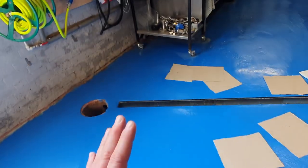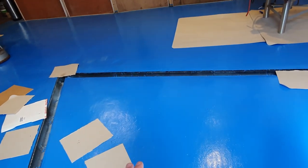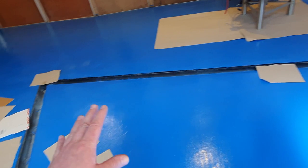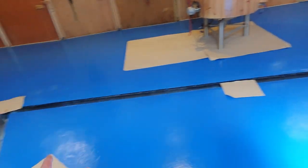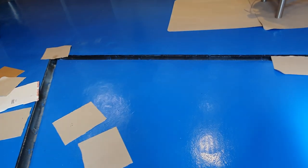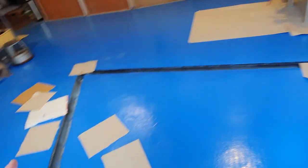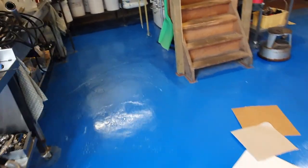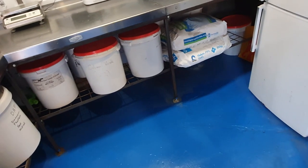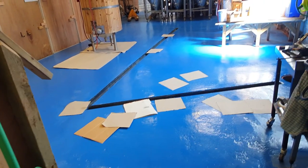The paint won't arrive till tomorrow. I'm hoping it will still be able to provide a chemical bond with another layer as it hasn't gone off completely. This second coat I put down, I keyed the whole area with a sander - believe it or not, it didn't take too long. The blue paint turned almost white, which gave me a mechanical key for the next layer and it's gone down extremely well. I also came across into this kitchen area - the floor in here was absolutely dire. We were working with uneven surfaces and I had to fill it all in with concrete, perhaps a couple of years ago on a vlog. It's been a really quite long haul to get to a finish like this, but I think it looks glorious.